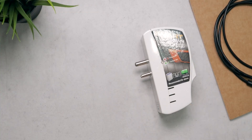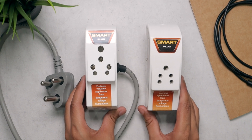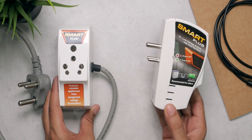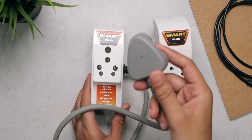All variants come in two types: one with a cord and one without a cord. If you don't have a lot of space on the switchboard, you can buy the one with the cord and connect your appliances to the smart plug. You can also connect this smart plug to an extension board and use all your appliances with it — so it does work with an extension board as well. Please note that you can use the smart plug with single-phase devices only. If your device has multiple phases, you will need to use multiple smart plugs — for example, three phases would require three smart plugs.